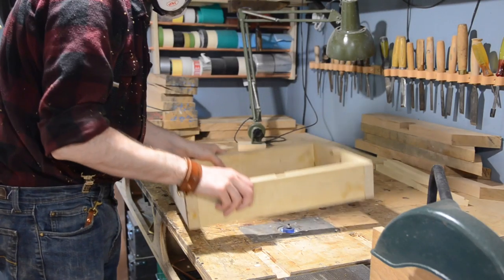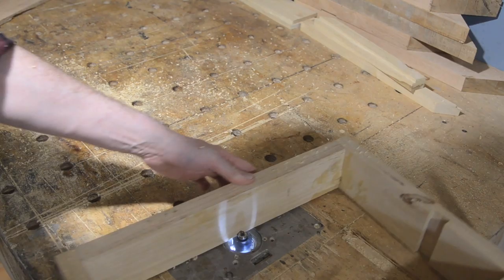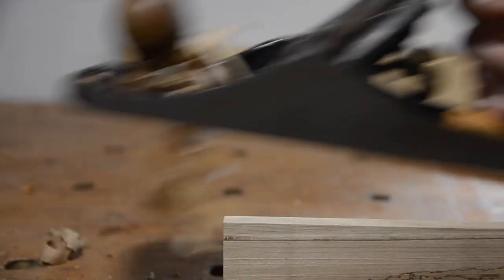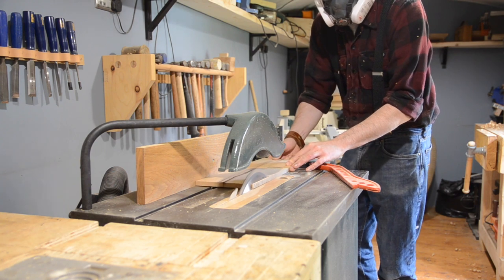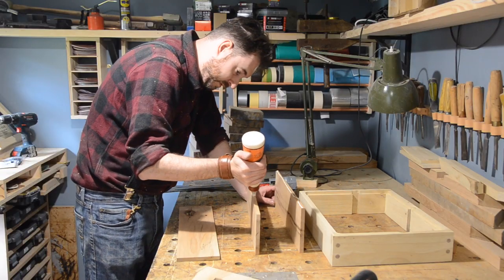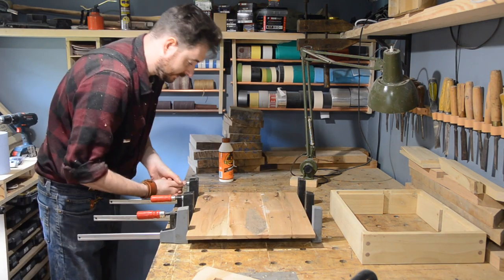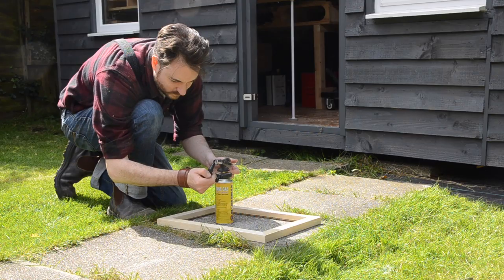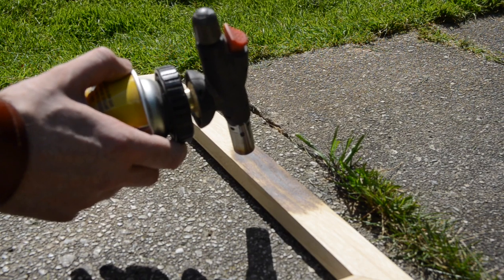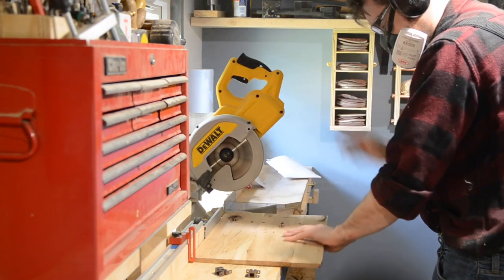The box needs a rebate to take the back panel so I'm just going to use the router for this. I raise a bearing-guided bit a very small amount and I end up taking three passes to remove all the material. I'm going to make the back panel out of oak so I joint one edge with a plane and then I run that along the fence of the table saw to clean up the second edge. I can then get the panel glued and clamped up and leave it to dry. While I wait for the glue to dry I can take the frame outside and work on it. With the blowtorch I can really burn it - I want it very black and the wood to start to blister. When the panel's dried I can get it cut to length and trimmed down to fit into the back.